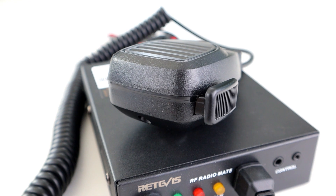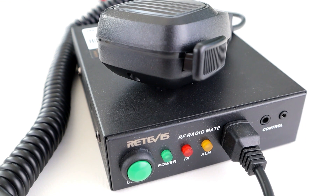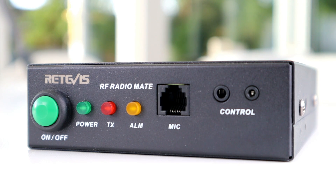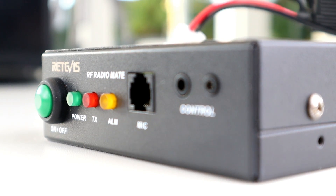Power isn't always everything, but with a decent antenna and the right conditions, the additional power can help massively. Sometimes the five watts these radios pack just may not cut it for the desired purpose, and that's where the RT91 comes in. We'll look at some features of this device and then set it up. It's quite portable and lightweight, and it's a wide coverage RF power amplifier for both digital and analog modes — it automatically recognizes digital and analog systems.